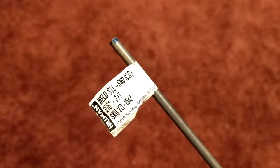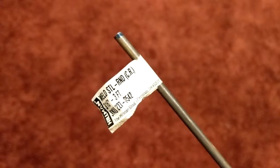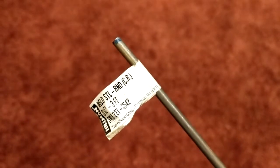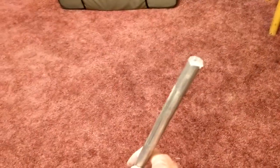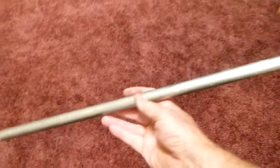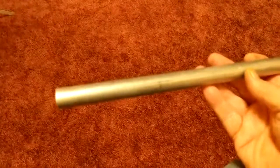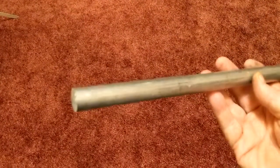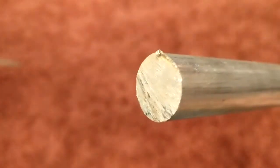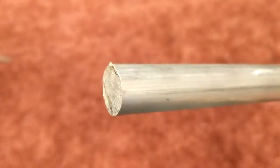Here's the 3/16" inch steel rod that I got from Menards — any store with a display of metal pieces would have the same stuff. And this is the 3/4" inch aluminum bar stock that I used to make the barrel washer. I cleaned up the ends; I've got a metal lathe. You don't have to make it pretty — you could basically use a large nut, cross drill it, and accomplish the same thing.